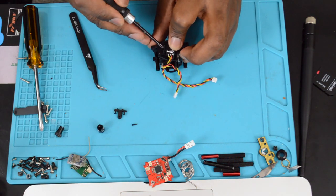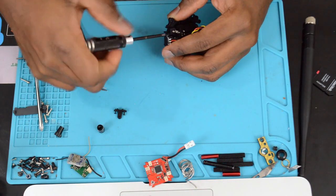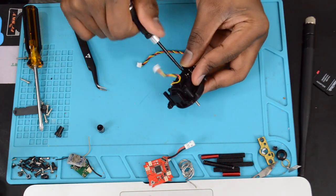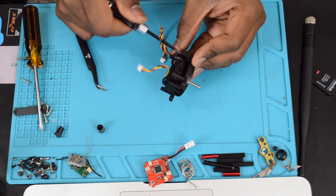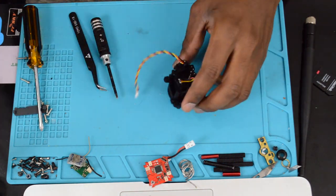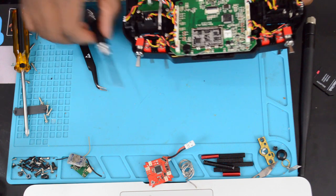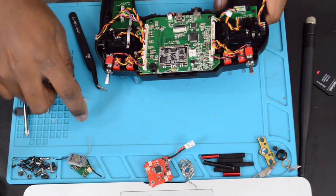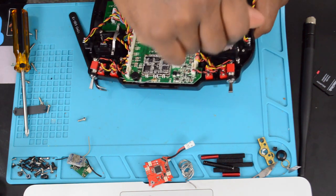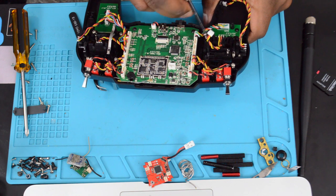Do the same thing again — put some foil folded up really small to close the space, because between both potentiometers there is a tiny gap from the retainer. It's really badly designed. Then put your gimbal back in, make sure you line it up properly. If you're not sure which plug goes where, mark the plug on the board with a red marker and mark the corresponding plug on the gimbal with a red marker so you don't mix them up.